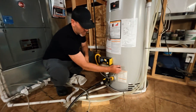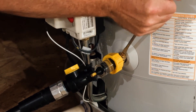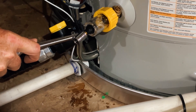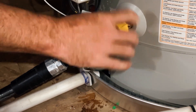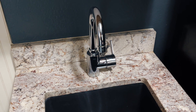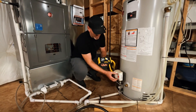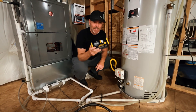In our situation we're good to go, so I'm going to go ahead and turn off the water heater's drain valve. With the Sediment Buster still engaged and open, I'm going to blow air out the hose — this way I can clean and drain the hose out, and then easily detach the Sediment Buster. After detaching, just go around and make sure that the hot water is running full and clear. That's it — simply turn the power back on, let your tank heat back up, and you're in business. Try the Sediment Buster; it is a game changer.